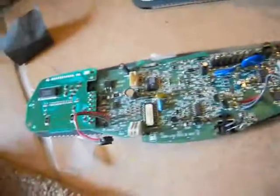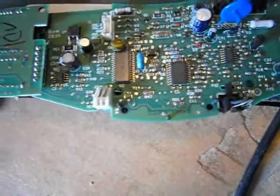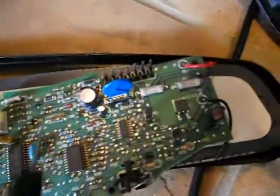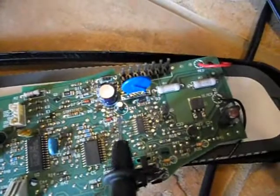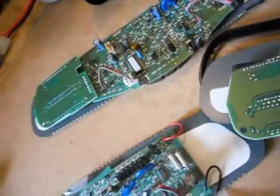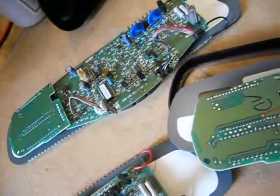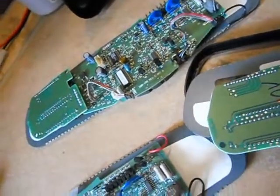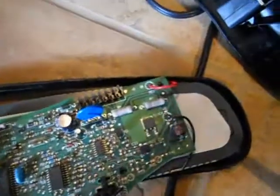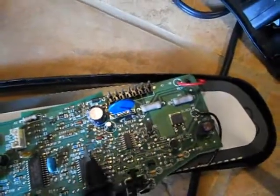Anyway, I was testing all these. These are the 220 WOM boards to get the little extra wires for the map lights. This is a 177 — those don't have the wires. These red ones, they flow in each direction, which is kind of strange, but the black ones don't. I had an old scrap radio board and tested a couple on there — a couple of them look similar, same deal. They're traveling both ways too. One way is a little more resistance, the other way is a little bit less resistance. I thought that was kind of strange. I've never seen that before.